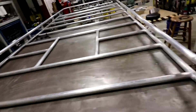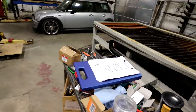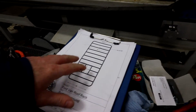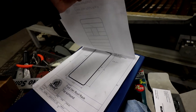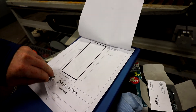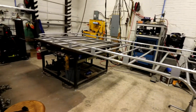It's all 6061 one-and-a-quarter-inch 125-wall tubing. It was all done in Fusion 360 — I designed it all there and printed everything out. As I showed you in previous vlogs, this really helps the workflow so I know my measurements and cuts without resorting to the computer. My radius, my cuts, the overall design right here — and it turned out with the exact same measurements within probably an eighth of an inch.